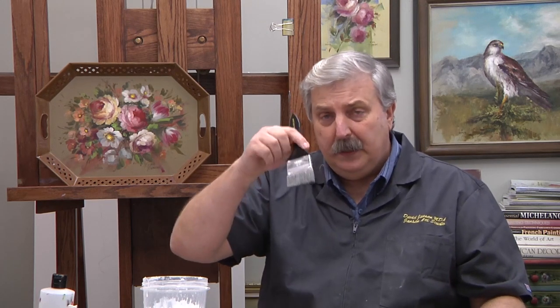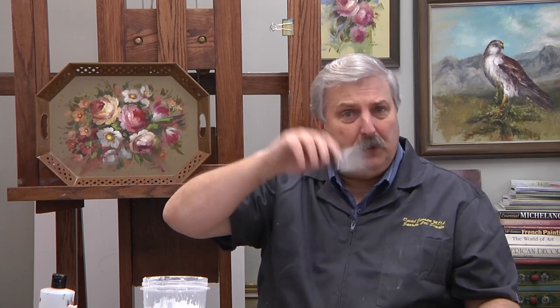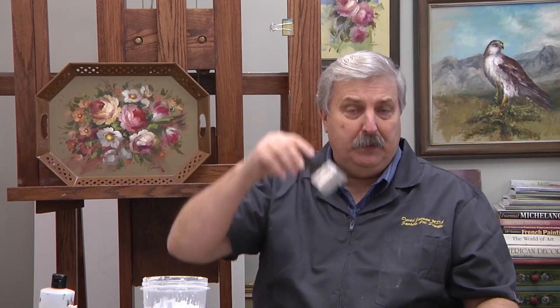The varnish itself, when you use the varnish, is really thick. It's made to be thick, so you can paint vertical surfaces, because we do a lot of furniture, and I do a lot. As a matter of fact, I'm just starting to work on another armoire, and I'm going to want to varnish that. And I don't always have the surface down flat to varnish it. Sometimes I'll be varnishing it vertical. So we make the medium really thick so it doesn't run down and sag.